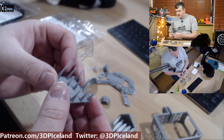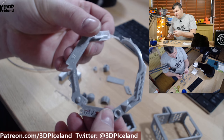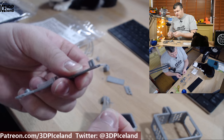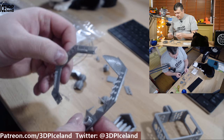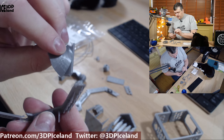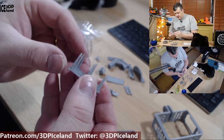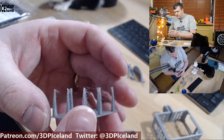One of the first tests I did was this one here — I've broken it into pieces. It was printed at 240 degrees and gave me really poor layer adhesion. As you can see, the layers were coming apart very easily. At 240 degrees it was not working well; the print quality was quite okay but it was very brittle with very poor layer adhesion at the lower temperatures.